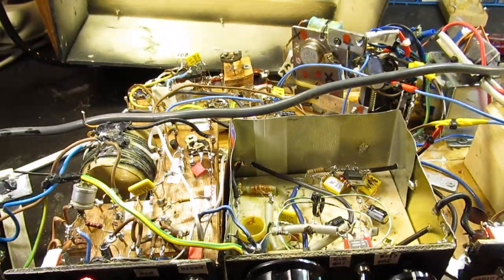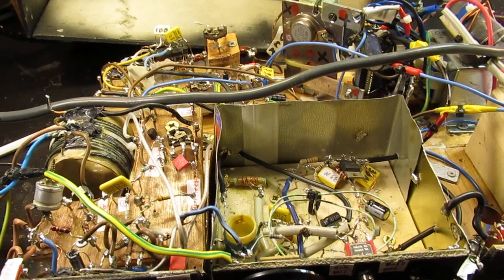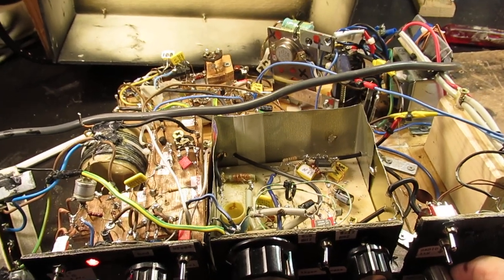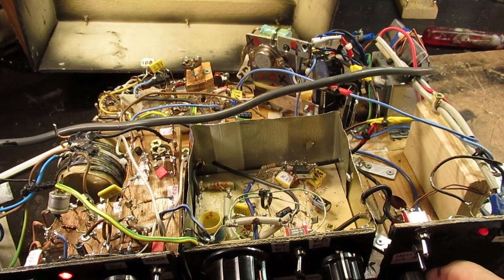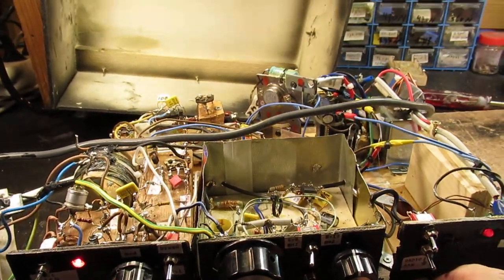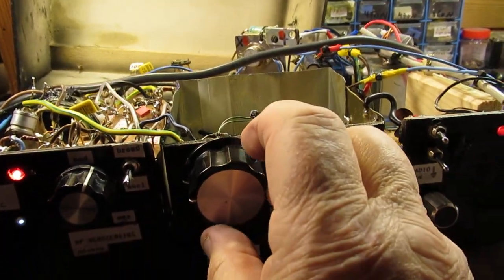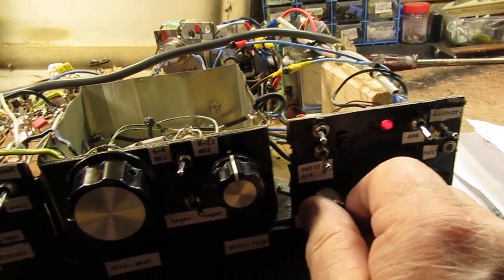And of course, this radio has no automatic frequency control, and it does not have automatic audio control. That means that it suffers from the classical fading. Radio stations fade away slowly or very quickly, and then come back again on that same frequency. And this is what happens here. Now the radio station is somewhat stronger. Anyway.